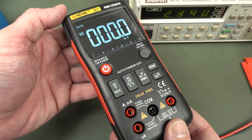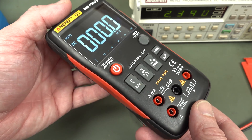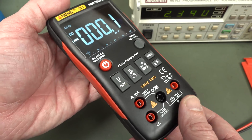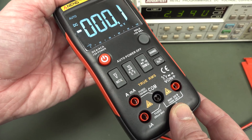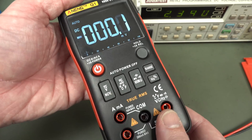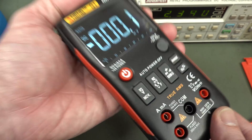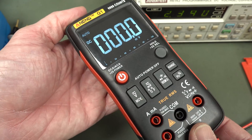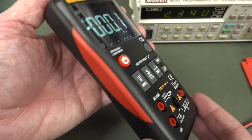So right then and there, this is done and dusted. I cannot recommend this at all. The display's not good enough to warrant that sort of battery life. At that dropout voltage — 1.25, probably 1.3 volts per cell for at least a half-readable screen — just forget it. It's useless. You're wasting half the capacity. So that 165-hour best-case nominal life — if you got probably 50 hours out of this for a reasonably readable display, I'd be surprised.